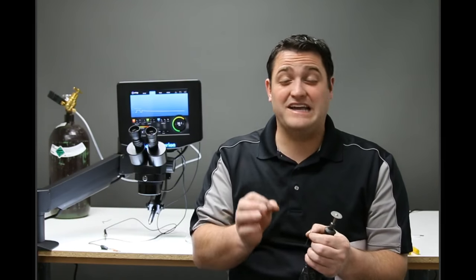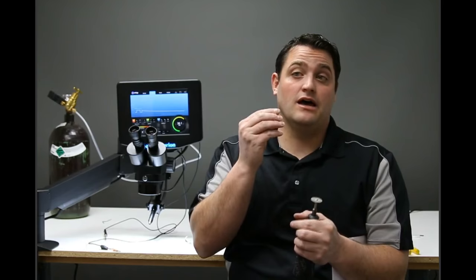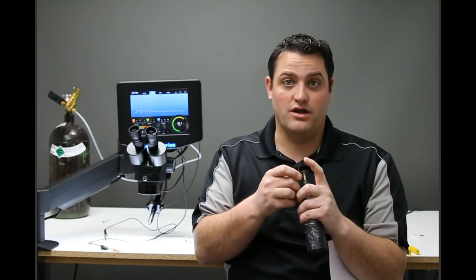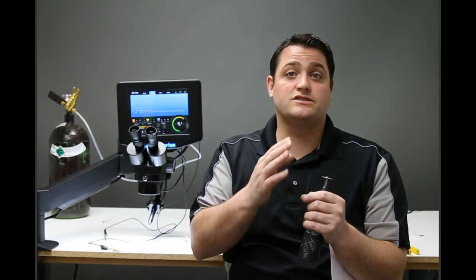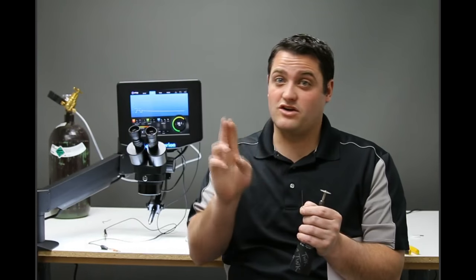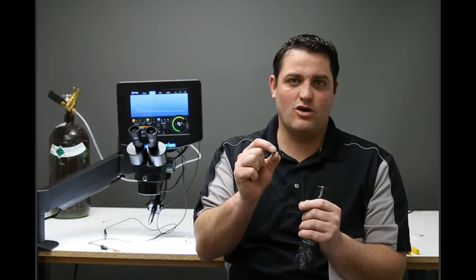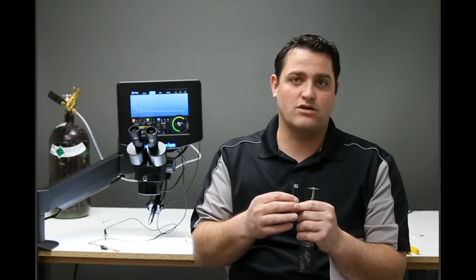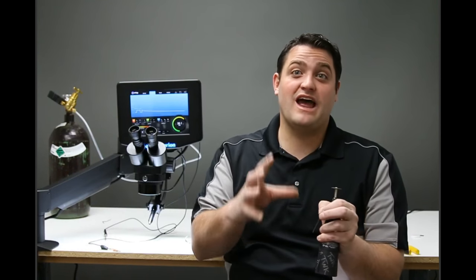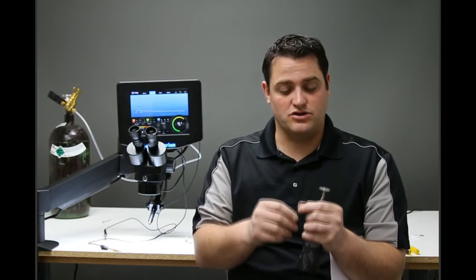If you're making really small welds — like a fine chain or a box chain — you can almost use a sharp electrode because you're not adding very much energy and so it's not pushing very much. The thickness of the silver is directly related to how much you truncate the electrode. We want a lot of melt: turn it up and truncate a lot. If we want just a little bit of melt, just a little truncated or even sharp at very low energies. If it's really truncated at 80% and you're trying to weld something very fine, it's going to melt around the piece more than specifically where you want it. The more precise you want to be, the sharper your electrode should be with silver specifically.